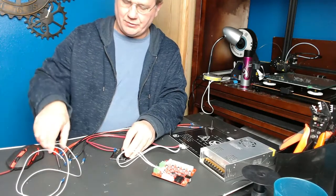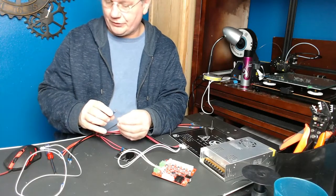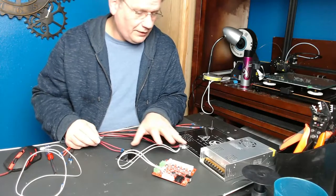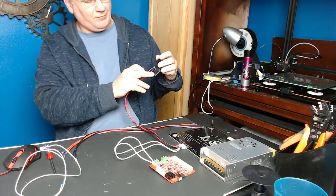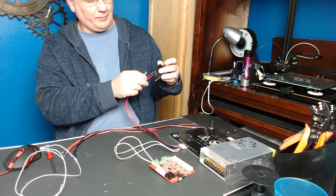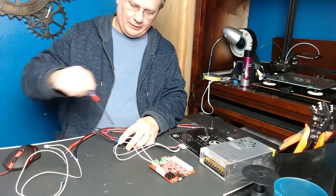I want to put two of them on the same screw — there comes the screwdriver. Remember, I said you need a screwdriver. The black ones go on the other side. There is no real polarity on the motherboard connection, but technically there is — polarity is listed on the board. If you look at your MOSFET board, one side says plus and one side is negative. The power connectors to the heat bed are wired the same way, so if negatives are on the right-hand side of the heat bed connector, they'll be on the right here too. That's how every one I've seen has been wired.